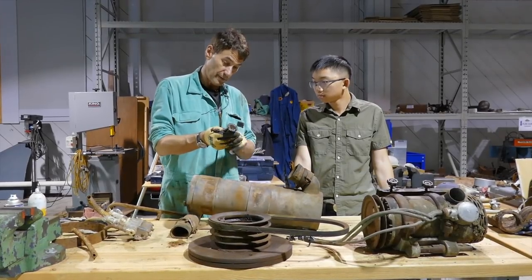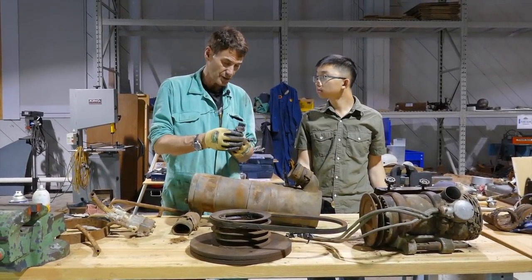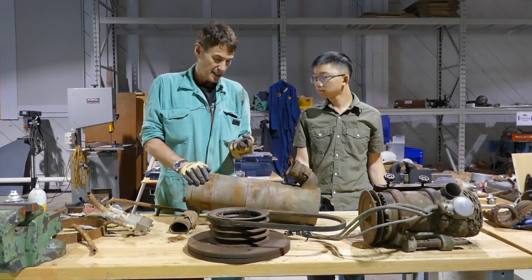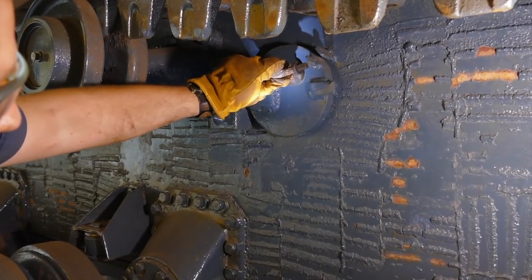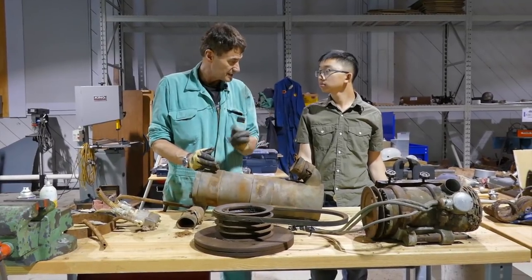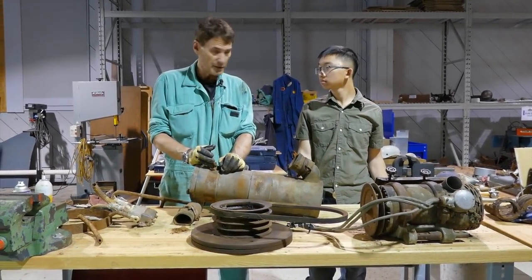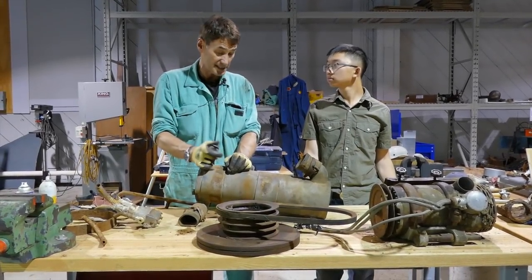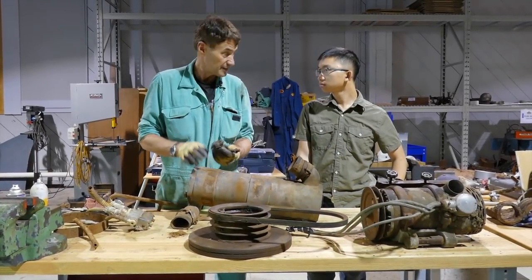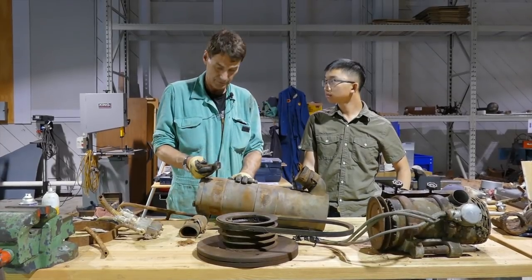There's also a wrench mechanism on this combination tool. It works on pointed armored bolts with squared sides, so the driver could fit that over and undo them. That type of bolt was used on the gas filling ports on the side of the vehicle, and also for opening up a small hatch on the rear plate armor of the tank. Once that was opened up, he could reach in and disengage the drive pulley that drove the cooling fans — there's a little drive shaft in there that couples onto the drive shaft of the cooling fans. When one wants to open up the back hatch it has to be disconnected, so he'd use that to fit on the bolt, wind it open, open up the little hatch, reach inside and disconnect it, or to fill up the gas tanks.